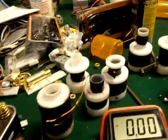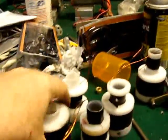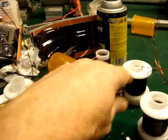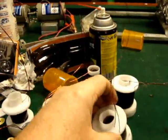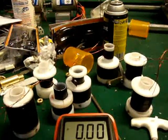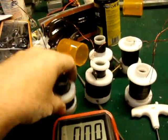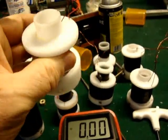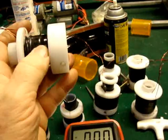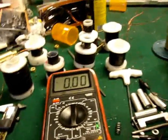I'm drawing up different types of coils. This one right here has got a lot of magnet wire around it. I'm testing different grades of wire — 25 gauge, 24 gauge, and 22 gauge. You're trying to get a little bit of voltage with some amps. You could have all the volts in the world but if you don't have an amp to support it you haven't got anything. Testing all these different configurations, I found out you don't really need a lot of magnet wire — it's how perfectly you wrap it. If you wrap that coil perfectly, going back and forth, it makes a huge difference.